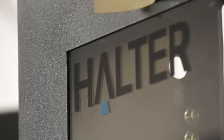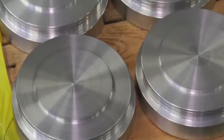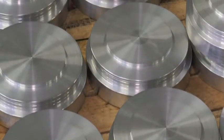You're an experienced engineer, but how easy is it to learn to program this machine? It's really simple — you can teach someone in 10 minutes. It's literally a few questions and answers: what shape is the part? Round. What diameter? 50 mil. How tall? 100 mil. How far is it sticking out from the jaw? 20 mil. How long is the jaw depth? 10 mil. And that's pretty much it — automation made easy.